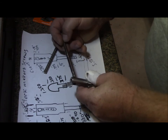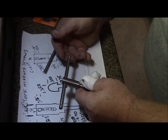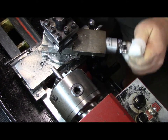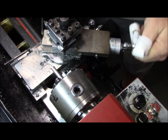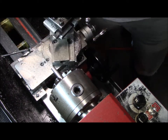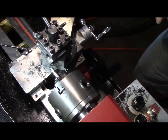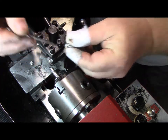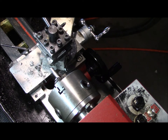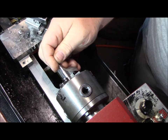In my haste to not wait until tomorrow to buy a quarter-inch ball bearing, I decided to go ahead and make my own. One disadvantage of a cheap Chinese lathe is you have to bring it way out just to change the angle, and even though it has a protractor on the side there's no index mark to line it up. Knowing the inner diameter of the spring is important — I'm trying to figure out the magic size, and it looks like 11/64ths, which is 0.172, fits like a glove.